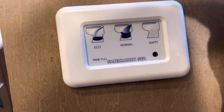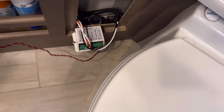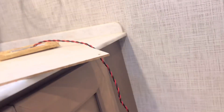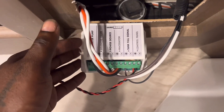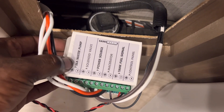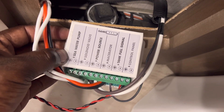These are 12-volt toilets. This one incorporates a macerator, so you've got a control panel with its own little circuit board, and a controller that controls everything else based on those control panel inputs. I'm not the first one to work on this - going behind somebody else happens a lot in this business because a lot of people can't work on this stuff. So this is where you want to start when something's not working - find the controller and start there.